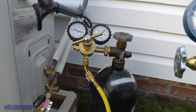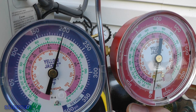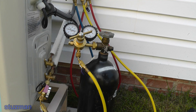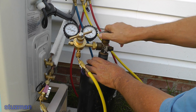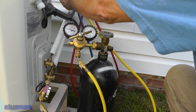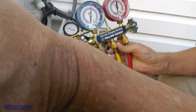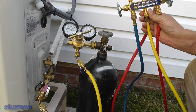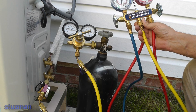I've already cleaned the fittings up in the duct — so there's another confirmation. Let's take a look at our low side pressure; as you can see it is still holding, and it's been close to 20 minutes now. Now to disconnect, we turned off the valve for the nitrogen tank. Then I'm going to open up the valve on the service manifold on the low side, and I'm going to loosen this valve and just let the pressure come on down.